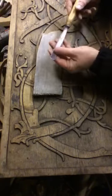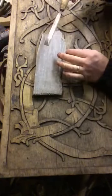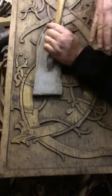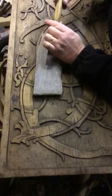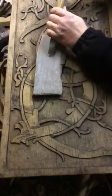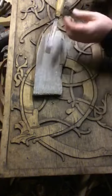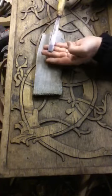So that's what the water's there for, to hold and make up a grinding paste. So you'd wet this, and then you want to find a way that you're comfortable, like standing in a certain way, using your hand like a bridge, like the carving we spoke about, or leaning on a surface, a bench or something. You're trying to minimize body movement as much as you can. So you're going to use just your wrists, or just a finger motion. The fewer bits you've got swirling around, the less inconsistent you can be. If you're standing not against a bench, moving your hips and your shoulders slightly, it's easy to get this tilted on and off, or to one side, or up and down a bit, and that's going to round off your blade, not get it sharp.